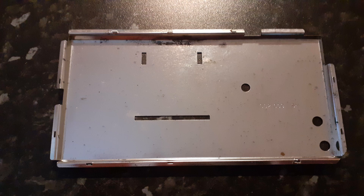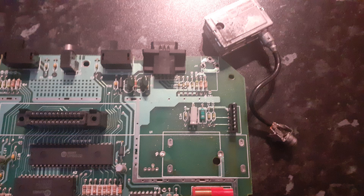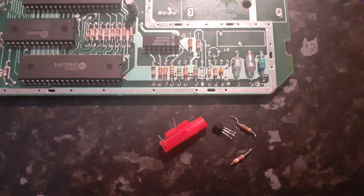The first job was then to remove the RF modulator. It has to be said, once you take this out the chances of actually getting it to work again are pretty much zero, so if you get this wrong you're probably going to destroy your console. Once you've removed the RF modulator there's also a number of components you have to remove - again once these come out the chances of putting them back in are fairly slim. There's a couple of resistors, a capacitor and some other component noted on the instructions.